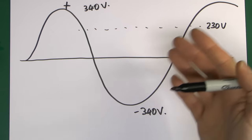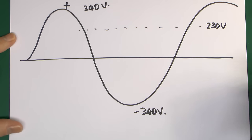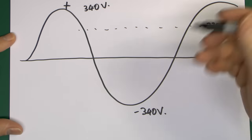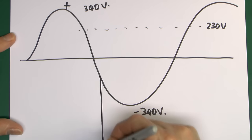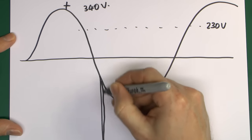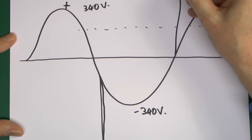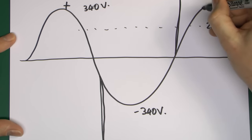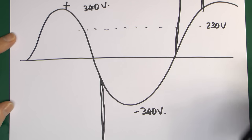In the case of a surge or transient overvoltage, it could be in either direction — positive or negative, it doesn't really matter. What you would actually see is that the waveform would be coming along normally, and then suddenly you'd have a huge spike for an incredibly short duration. You might have another one shortly after — a spike way off up there. Very, very short pulses but quite large in total voltage.